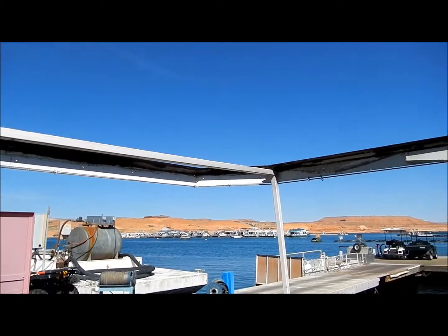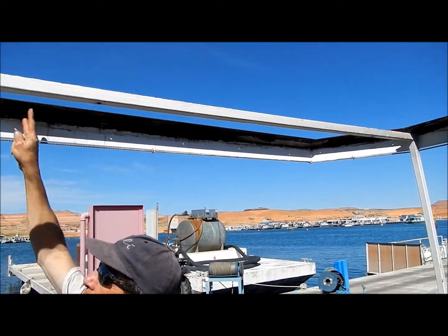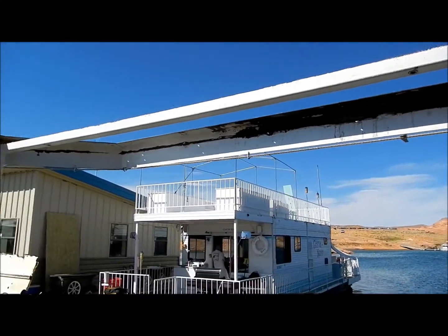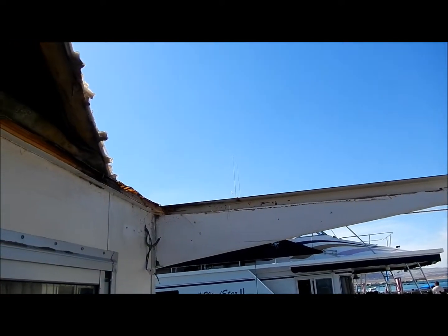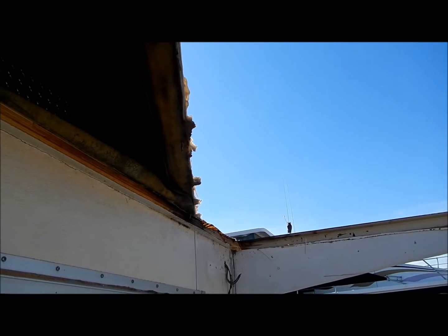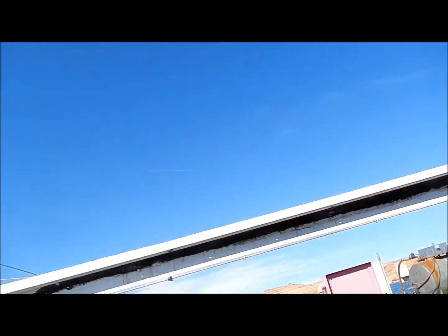Did you tell them that this is a 3-inch lip with 2 screw holes all the way around? Yeah, I told him that. I showed him that. You're going to have to interleave the 5/8, or you're going to have an issue trying to support this type of span. The cool thing is the span from front to back is less than 8 feet. So that's an important part.